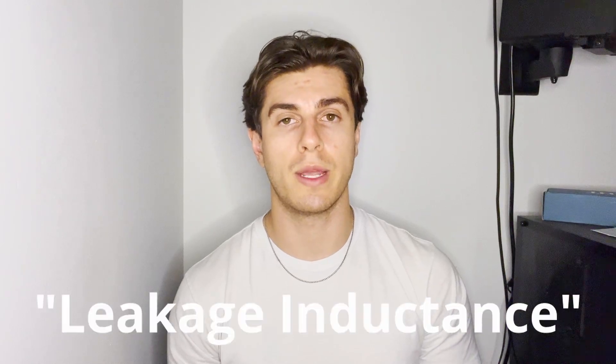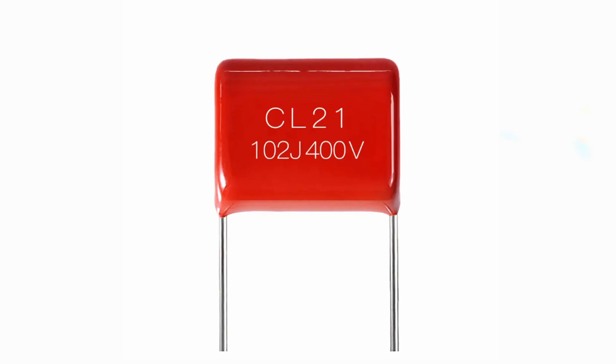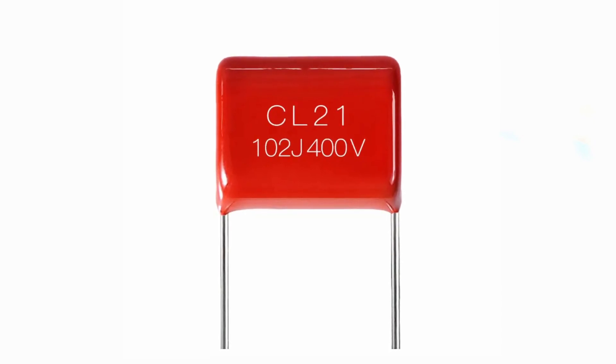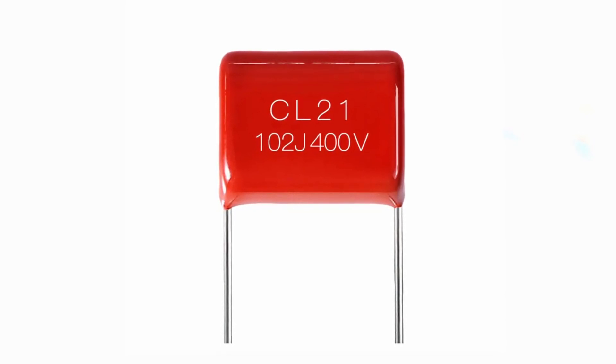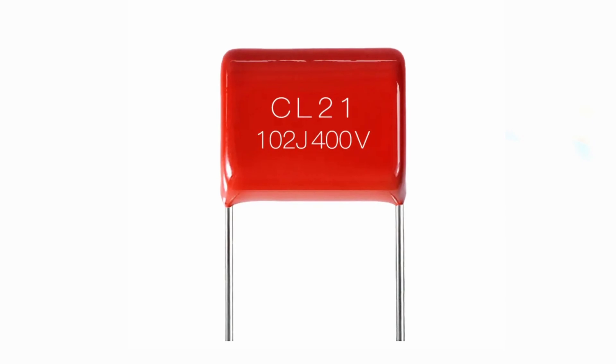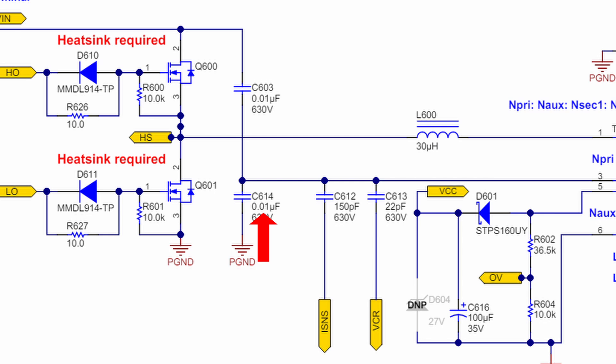For the transformer specifically, you'll want to be familiar with leakage inductance, as this impacts the inductance value of your resonant inductor. For the resonant capacitor, important parameters include the voltage rating, capacitance value, ripple current rating, and equivalent series resistance (ESR). A film capacitor is typically chosen because it offers very high voltage ratings, very low ESR, and very precise capacitance values — which is critical since capacitance values in this application typically range in the tens of nanofarads.